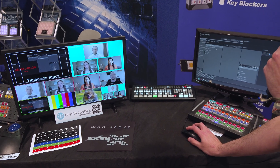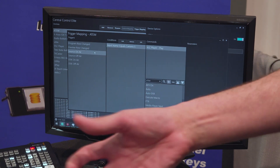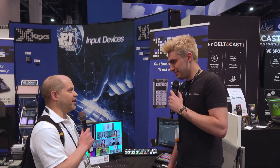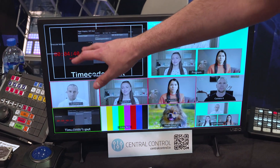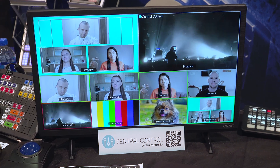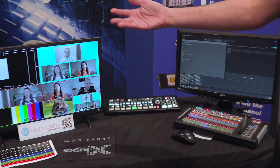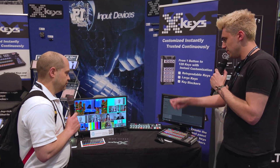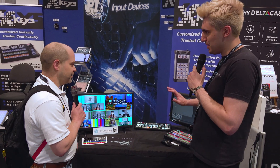We've got the trigger section of Central Control, which provides simple if-else logic — if this input is on program, then we trigger these actions; if it goes off program, we do these other actions. That's one of the big things missing from BitFocus Companion: you can't do things conditionally. So I've got my VLC input in preview on camera five, and as soon as I hit the auto button, it automatically rolls the video. I can even set it up so when VLC reaches a certain amount of time remaining, it dissolves back to whatever's on preview. As soon as it goes back off to preview, it cues up the next video clip — ready to go. It really allows for a one-man-band operation, running the entire show from a single control panel.